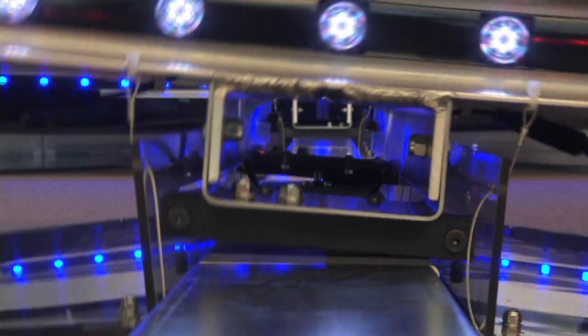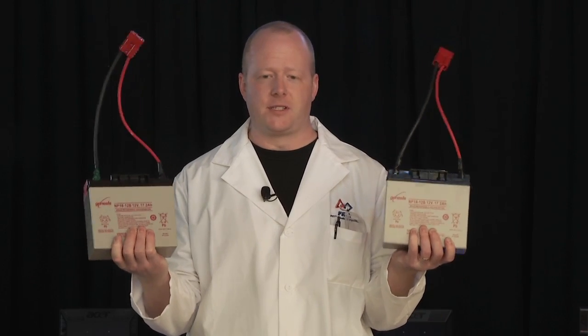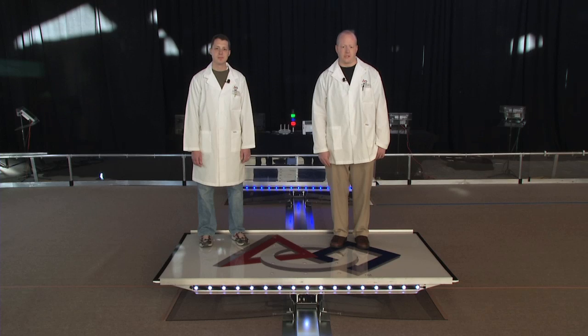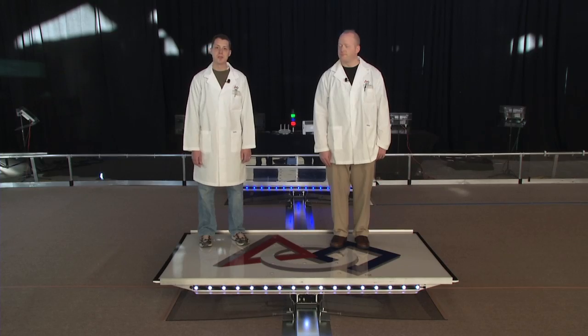Please be careful around them at the event and at home because of the different pinch points. Here's a test you can do to make sure your bridge has similar dynamics to the official bridge: take two FRC batteries and place them 28 inches from the center of the bridge — the bridge should stay horizontal. Now move the batteries two more inches away from the center and it will tip to that side. That should do it. Be really careful around the bridges.